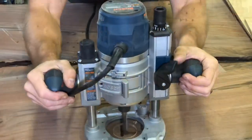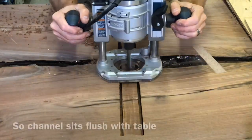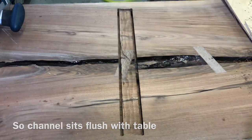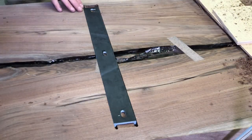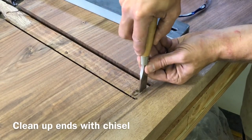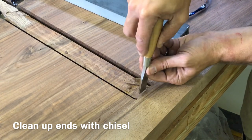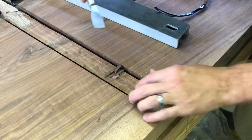You don't have to inlay these completely flush, but I decided I wanted to, and so to do that I just routed out the thickness of that top plate. Just make sure those strips you routed are deep enough for the entire C-channel to fit into. You may be wondering why I didn't do a better job measuring — this was actually intentional. You want room for the wood slab to expand and contract; you don't want it to bind on that steel, so I left about a half inch of room on either side of the C-channel.